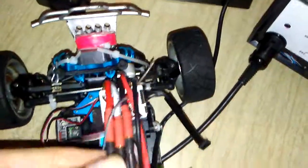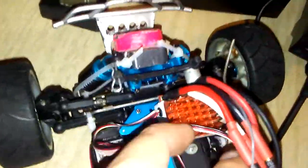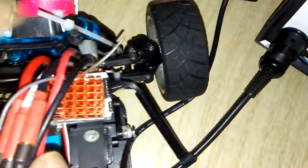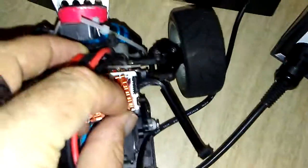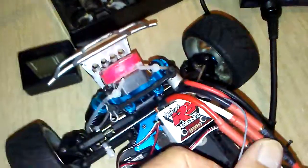and what I had to do so far was, I'm trying to get the right angle, guys. I'm sorry. On this ESC, I tried to cut this to size to fit really good on here, and still be able to access the sensor wires and the communication wires, and then keep a gap to make sure, no matter what, I don't touch this capacitor, because the wires aren't that exposed, but a little bit of the solder is. You can't get shrink wrap that low. If I've got a bad camera angle, guys, I'm really sorry.